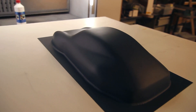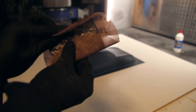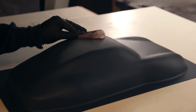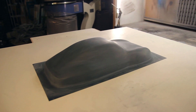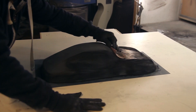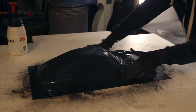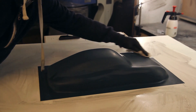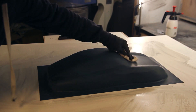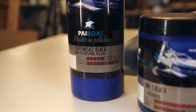Once cured it has a dull finish — not a high-gloss perfect finish, but good to start sanding. Instead of 150 and 240 grit, we now start with 400 because we're close to finished. The orange peel sands off quickly and easily. I use 400 grit and then add some control powder — a fine powder that gets into the scratches made by previous sandpapers so you can see where you still need to sand. Then I wet-sand with 400 and finish with 800 grit, which is mostly enough for a pattern at this stage since we'll still be sanding the mold later.